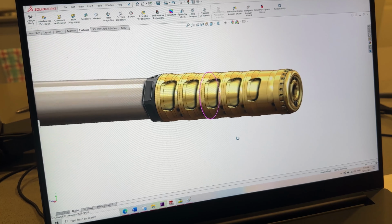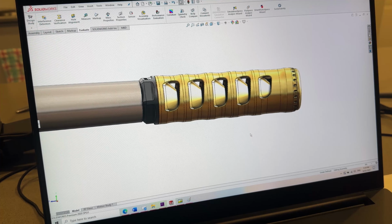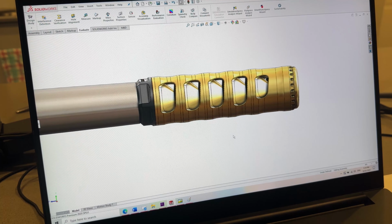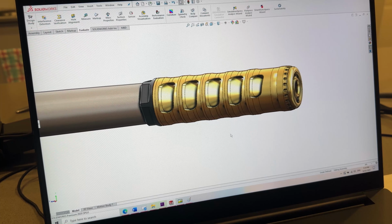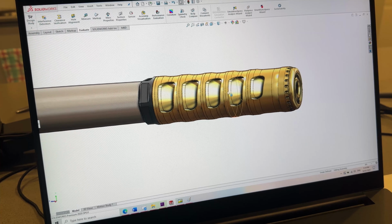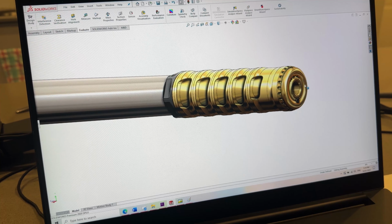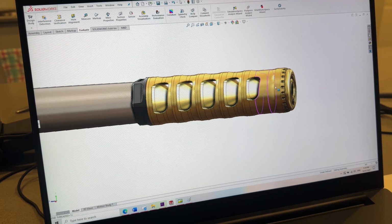And it just results in a far better product and a far more durable product as well, because the TMB really can't handle a 338 Norma and stuff like that. But this will handle anything. This is very thick 304 stainless that's CNC laser welded. It's just as strong as having a rod of material and machining into it like a normal conventional muzzle brake.